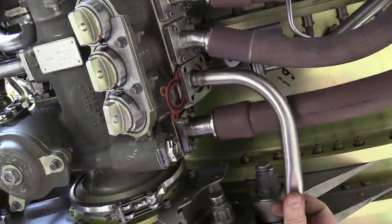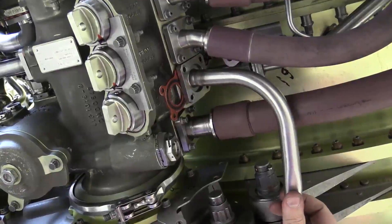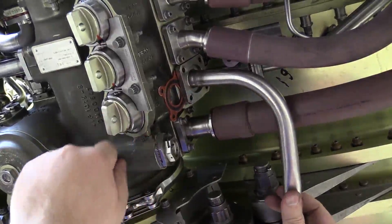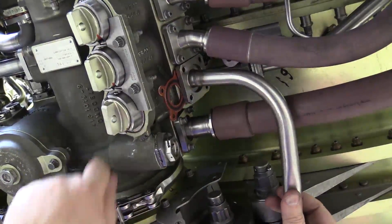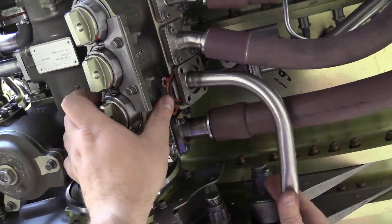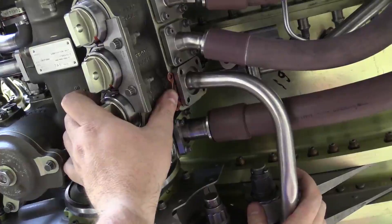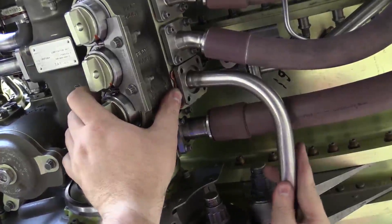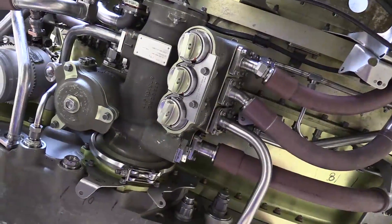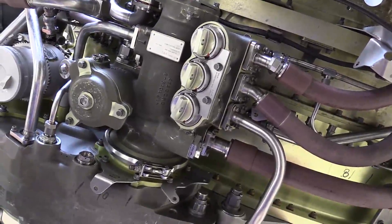Part of this video is sharing maintenance tips. We want to show you a couple of things to avoid when installing manifold tubes to the lubrication unit. Here we have a tight tube — we're trying to get the gasket seal up between the manifold and the lubrication unit. Avoid pushing the gasket seal in between, as this can cause damage to the o-ring material and cause leakage problems during repair confirmation. We went ahead and removed the gasket seal, re-inspected it, and then reinstalled it correctly between the manifold and the lubrication unit.